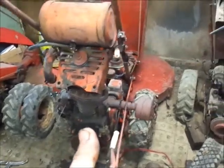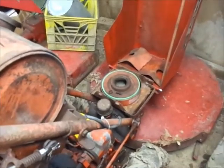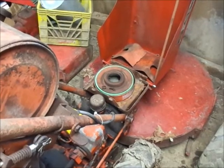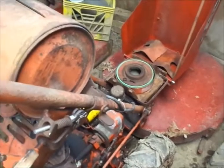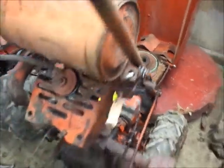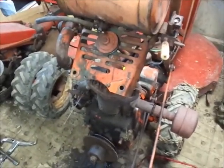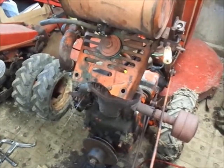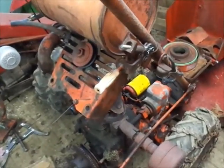And at this point, you've got it in the air, but like I figured it would, that extra bracket is in the way. So, since it's not factory, I think I'm just going to cut the weld loose back here, and I'll twist it up around a little bit, and I'll bend it back down, and maybe I'll put a bolt in it or something. Yeah, see what happens. But really only 1, 2, 3, 4, 5 bolts holding the motor on, 2 oil lines, and a mag coupler to boot. Then the motor will be off. It don't take long.